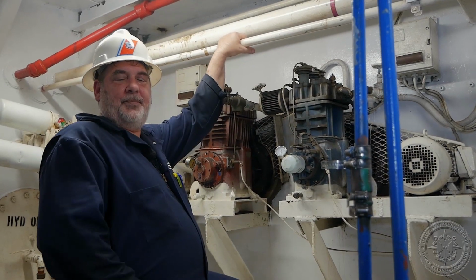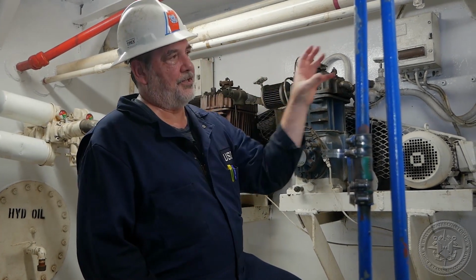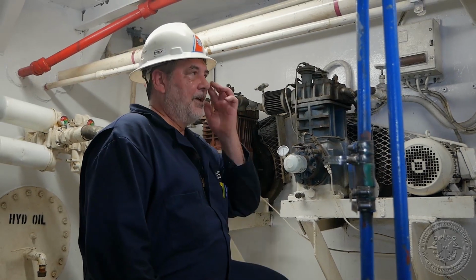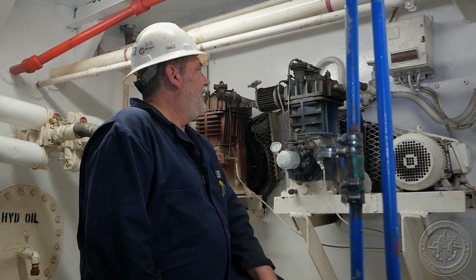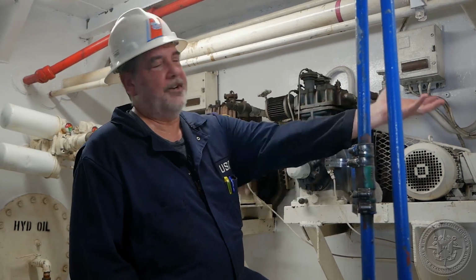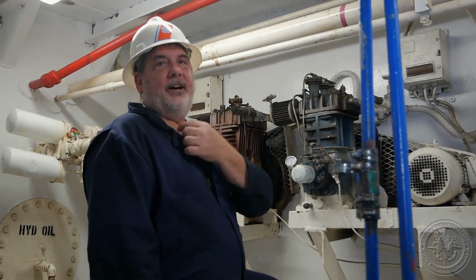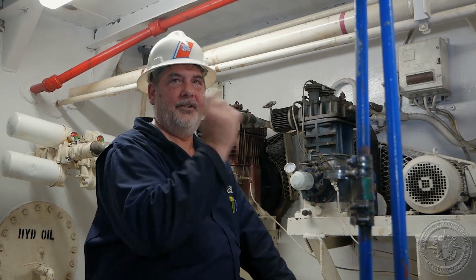One safety item the inspector must always be aware of is the compressor system that is feeding air to the pressure vessels. When you are asking the vessel rep to increase the pressure on the air receivers to either test the safety valve or anything, occasionally the compressor system is not designed to put enough pressure in the vessel to lift the safety valve. In that instance, you may accept them taking the safety valve off and either bench testing it or putting a new one on that has certification papers with it.